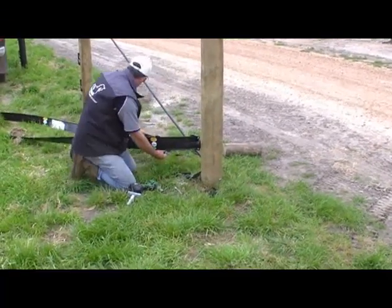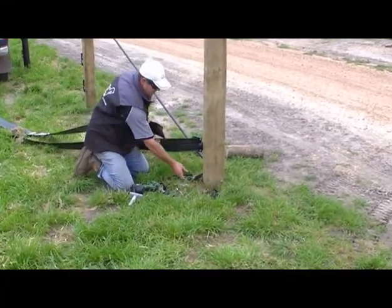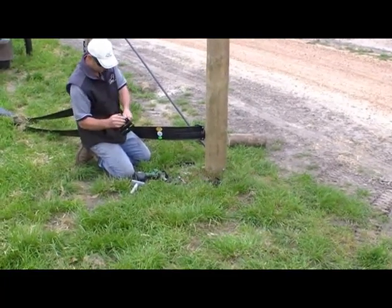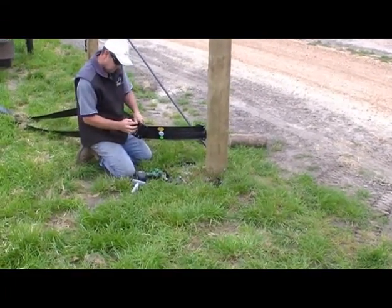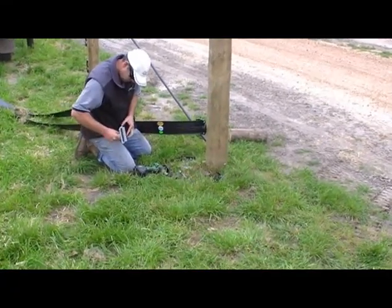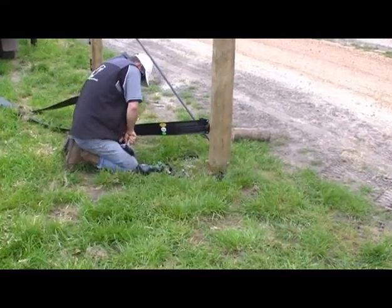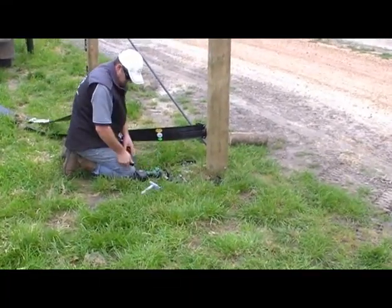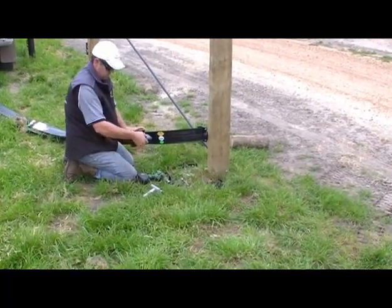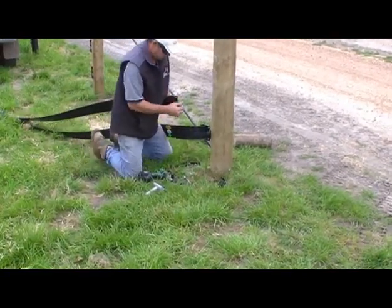We use the same coach screws as we do on the 90 degree corners, using a 120mm long M10 or M12 galvanised coach screw. It can be fiddly placing the rail in the buckle and also in the bending tool, but after a few tries it becomes a lot easier. Just like using a normal belt buckle.